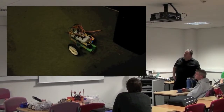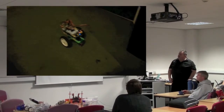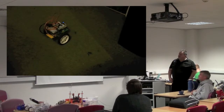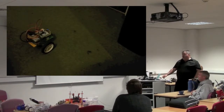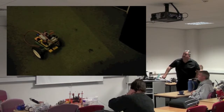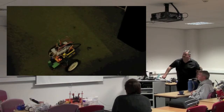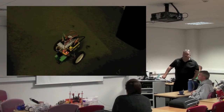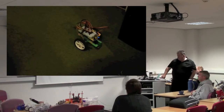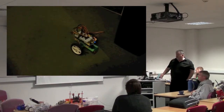It'll need little tweaks, but by simply pressing the S key on my keyboard — it's all done in Scratch — the bot should go forward and basically draw a square. That's the first side done, second side done. It's got a long delay in there to allow for the turn. It basically says go forward for five seconds and then turn. The turn command says turn the steppers 200 steps, and with this size wheel it does a 90-degree turn. Hopefully you can see that was fairly repeatable.